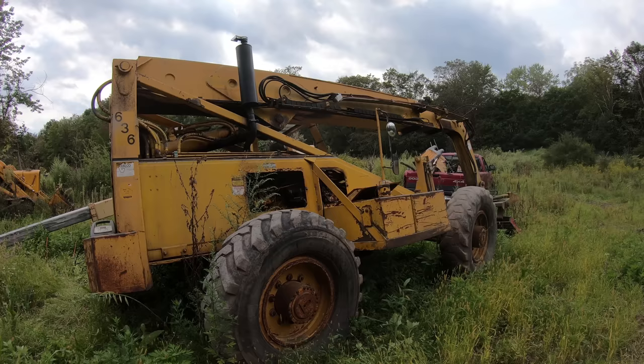So I think I'm actually back feeding by hooking up to this red wire right here. I think this red wire is supposed to go to something right here to power it. And then I found another wire that was loose down here. That's this red wire. And when I put that against there, turn it on, then I also have dash power. And I think that beeping is because of the engine oil. It's sensing low oil pressure. So let's start it, see if that goes away.